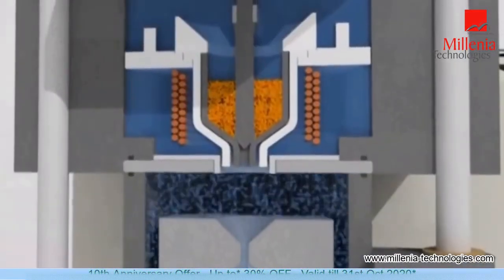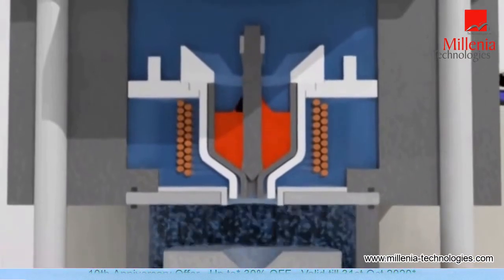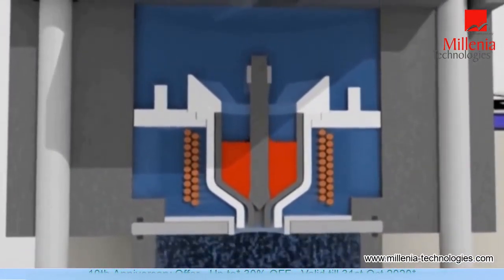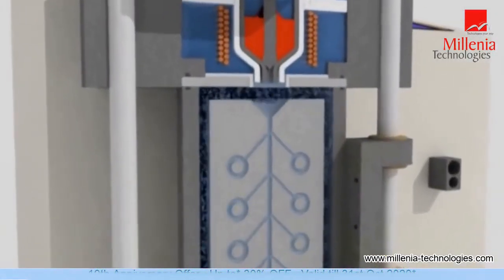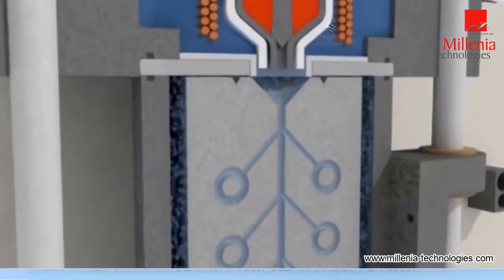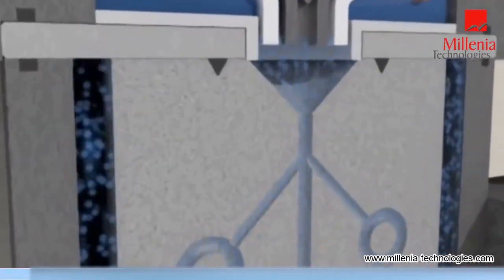The casting temperature is attained, and low-frequency pulses are given to vibrate and mix the molten metal, keeping it homogeneous. At this stage, the flask is pushed against a long-lasting special metal sealing blade system, or SBS, which, like a knife, cuts the investment by sealing the vacuum underneath the flask.